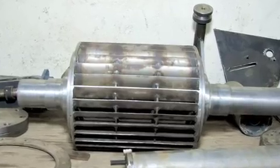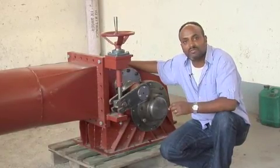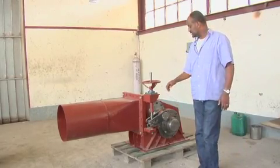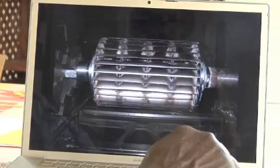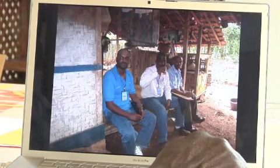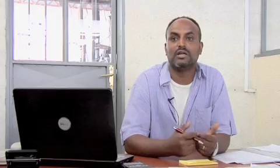When the runner is rotating, we use a pulley from the backside to transmit the mechanical energy to electrical energy. The turbine is manufactured here locally in Ethiopia, and the design we got from Indonesia. I was in Indonesia for a one-month manufacturing training. After the training, we tried to manufacture it according to the specifications and design from Indonesia. We visited different micro-hydropower plants, associations, private users, and mechanical workers to see how the technology is disseminated and how it functions.